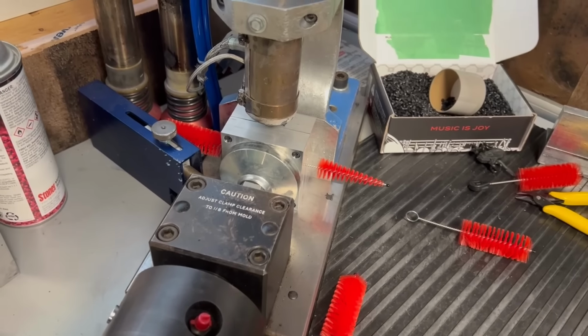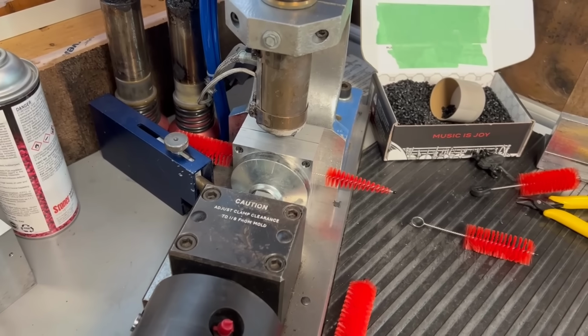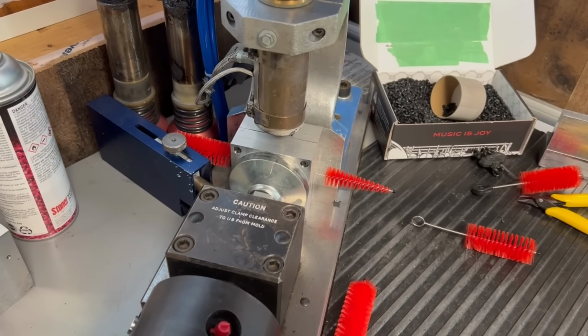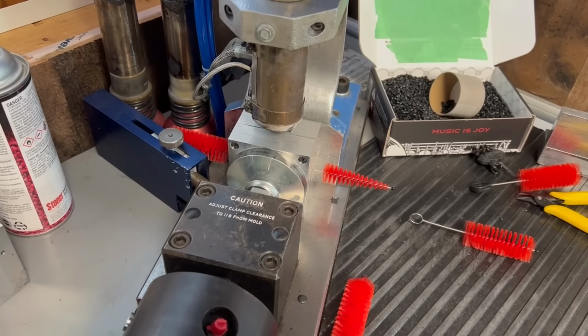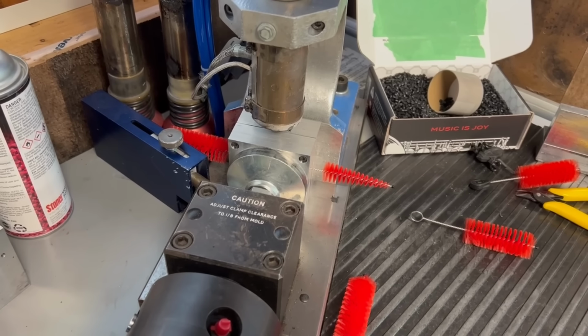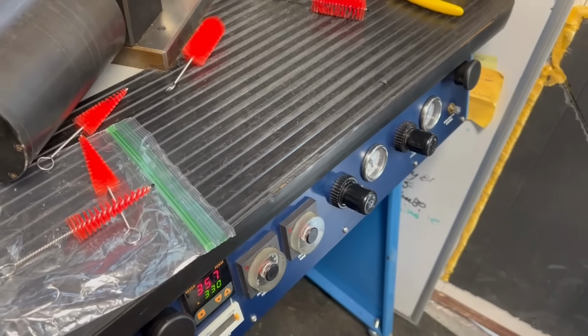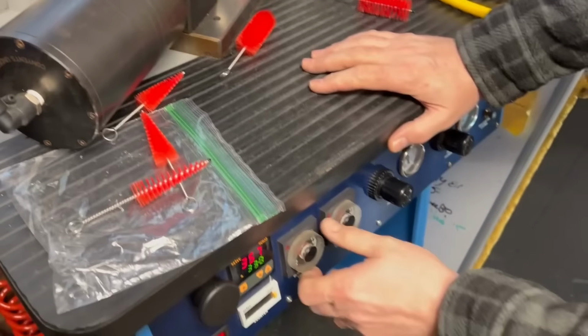And then you probably want to increase the holding a little bit. Yeah, I've got the holding at 100, and I'll inject the pressure to where we were at about 55. Let's see what happens. And we're going to keep the same inject time as we did on the... well, this is a bigger part. Let's go to 3 seconds. And then hold time will also increase a second.